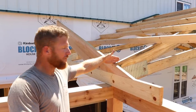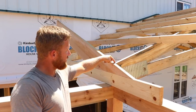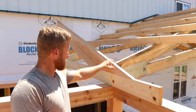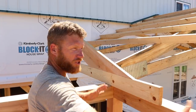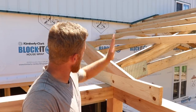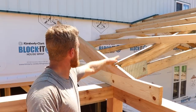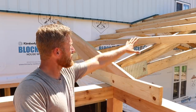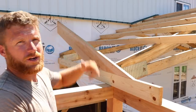So I've still got a 2x4 that's gonna go on top of this and a 2x4 that'll go on top of this. But basically this is telling me that things are going well, and you know, that's because math never lies. So now what we gotta do is, basically I gotta run some fascia on this, then I can tie my fascia here, and then that's gonna give us our valley point up to way up there where maybe you can see our trim detail came together, you remember that? So that's already been defined. We got the other side sheeted, and once this side over here is sheeted, then I can run my purlins over top like we did going into the garage on the other side.